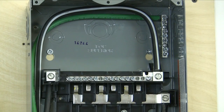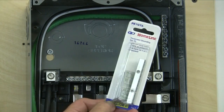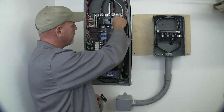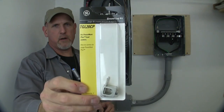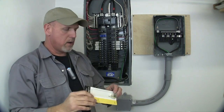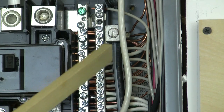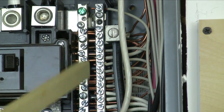You pick up something like this and just screw it in place. There are several different places where you can mount it if there are holes that are already pre-threaded. For me it made sense to mount it right here and you just screw it in place. Now these number two wires are really big and really thick, and the problem that creates is on your neutral bar — that wire is too big around to slip in the hole. So what you have to do is get one of these lugs. It's got little tabs on the bottom that slip into your neutral bar, tighten down, and then that lug is big enough for the number two wire to go in. You can see that lug and my neutral wire going into it, with those tabs slipping right into the neutral bar and tightening down.